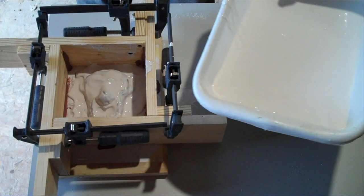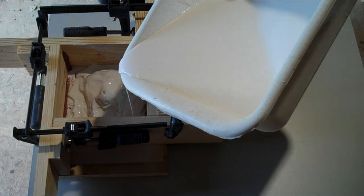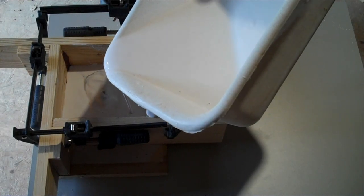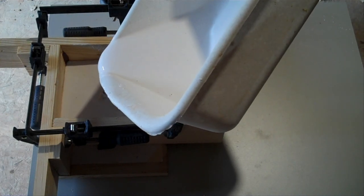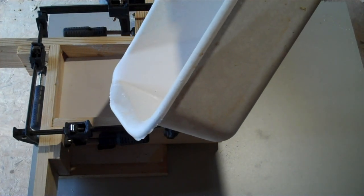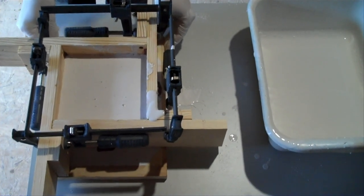This beauty coat helps make sure that there are no air bubbles trapped between the plaster and the model surface. Now begin pouring in a deep section and let the plaster run over top of the model, rather than pouring it directly on. You can tap and shake the box to try to drive any air bubbles to the surface.